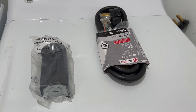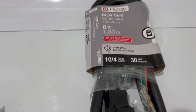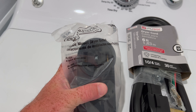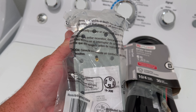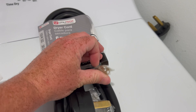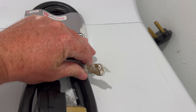I am not a professional — do not do what I'm about to show you. But if you're interested, this is how I'm going to do it. This is a dryer cord; it is a 14-30, as you can see right here. You can get this at the hardware store — I'll put a link in the description. I've also gotten a wall mount for a dryer outlet, also a 14-30. This back plate is going to mount to the wall, and I'm going to run this cord over here and poke it through the hole so that the ends are sticking out into the garage, then mount this there, pull those through, and wire this up.